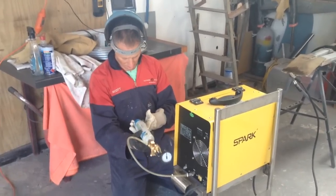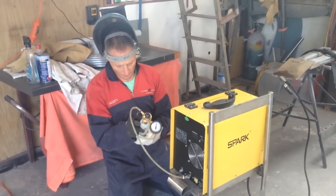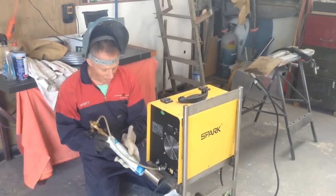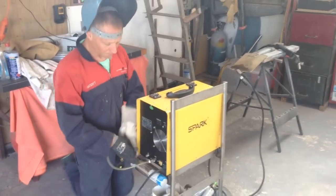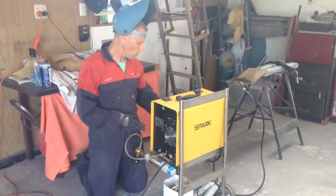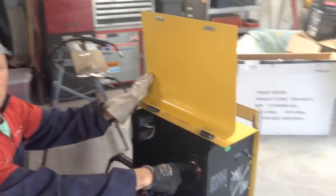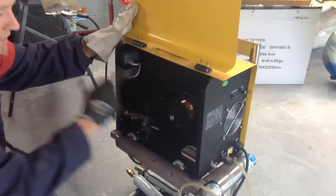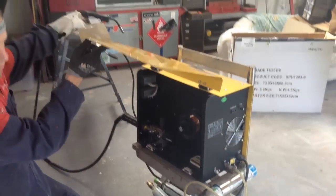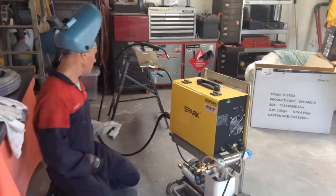These bottles are pressurized up to a bucket load — it's unbelievable how much pressure is in them. There's a ton of gas in here. I've had one of these, started with an almost full small MIG wire spool, welded a floor pan on a vintage VW with the doors down, no wind, just quietly purging through the CO2 through the welding nozzle — and had one bottle last the entire spool. The stop-start uses it up, but if you're doing plenty of runs it goes a long way.